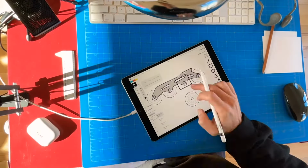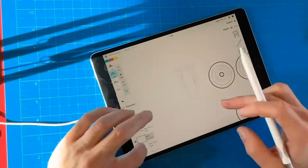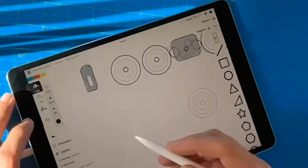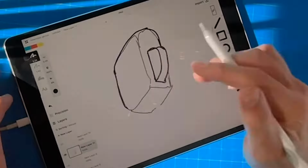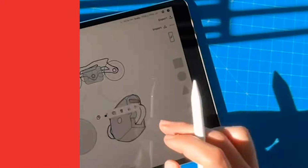In the second concept, which is a little more advanced, I started with the four-wheel frame. The idea is you take out the wheel that's under the most weight under the foot and replace it with this cassette. These would have two wheels that are constantly engaged with the wheels on the sides, similar to Jackson's drawing. I think this is adventurous and cool in two ways. One, these would always be engaged, so you could use it to power LEDs and charge a battery. But then using the remote, you would energize the motor to resist the turning of those gears, applying braking force that way.